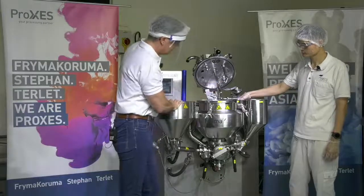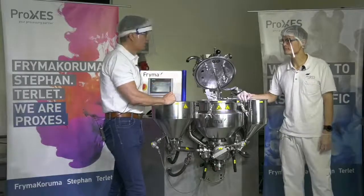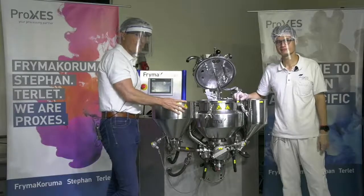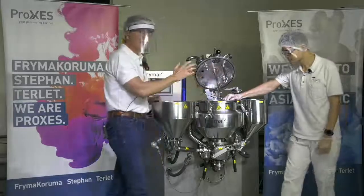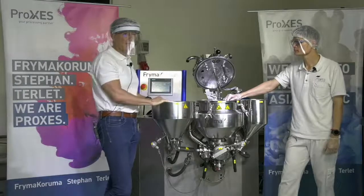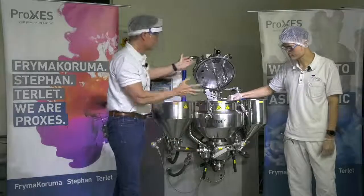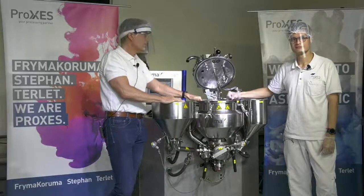We have both side vessels here - one for dry and one for wet ingredients. All liquids go in the wet vessel. For fats or anything you need to melt first, there's a double jacket on it. Other ingredients like sugar, powders, salt go into the dry vessel so you don't get clogging. Everything feeds straight into the machine via vacuum. The whole machine is closed and works under vacuum.